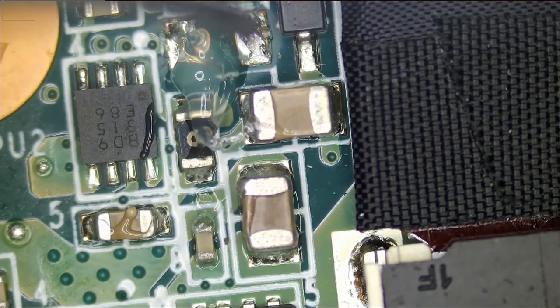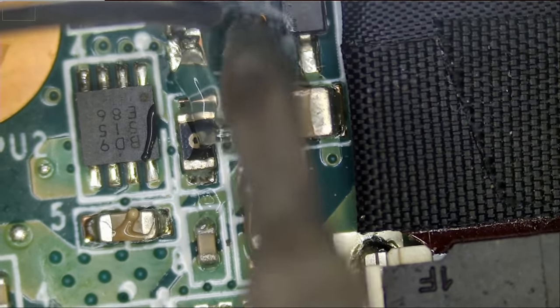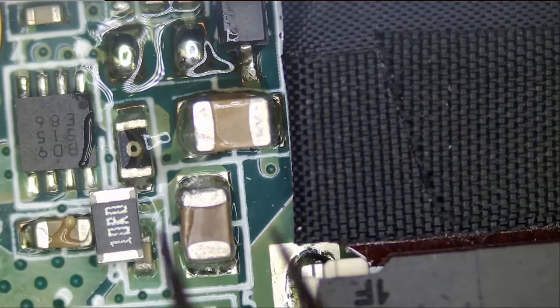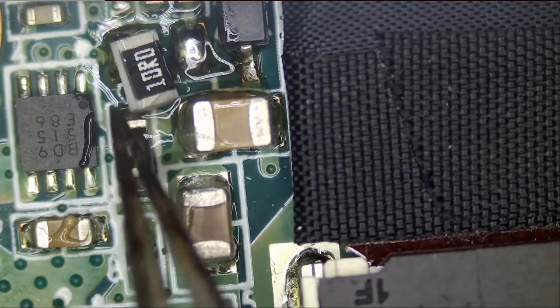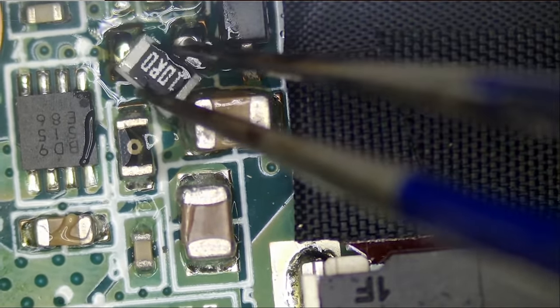The question is: how did that component fail? We do not know what went on with this laptop to cause this filter or resistor to blow. And that's exactly the same resistor. How did I know the size was 805?